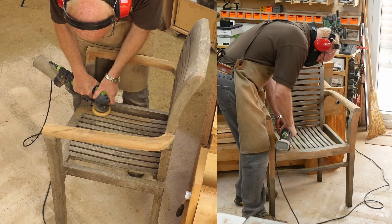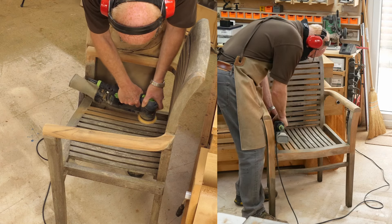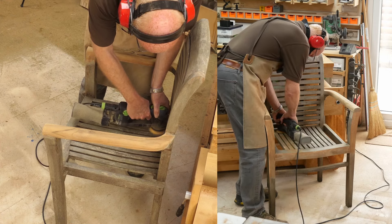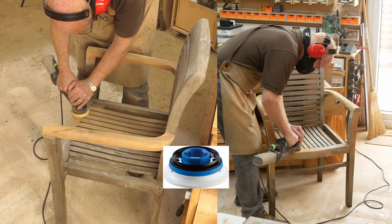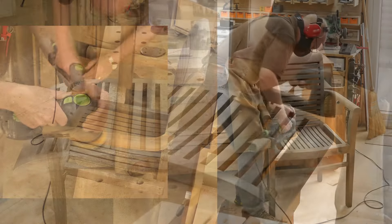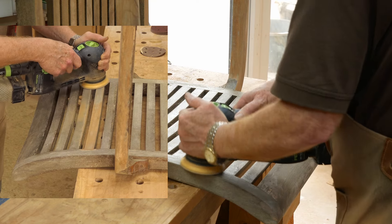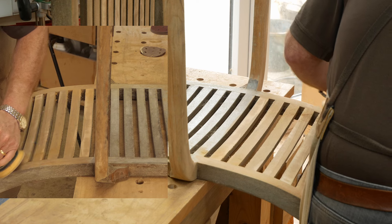The RO90 is available with two different types of pad. The white pad I've got on is the softer pad, much more appropriate for surfaces with delicate edges or rounded corners where you don't want to introduce a flat spot. The hard pad — blue, I believe — is more appropriate for dead-flat surfaces so you don't introduce any unwanted rounding. I'm going to continue with the soft pad in fixed direct mode for as many chair surfaces as I can, up to the point where the sander starts to grab, rip the paper, or risks introducing flat spots, at which point I'll switch modes.